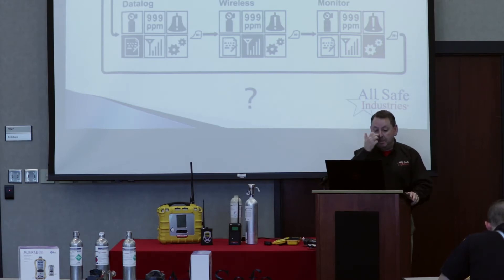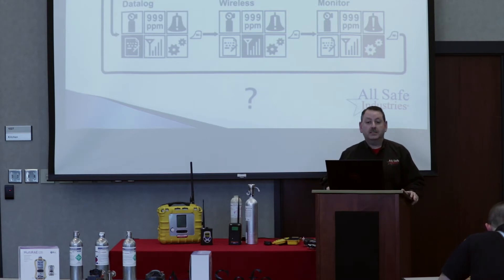Hit the back button to jump out to the next main menu. The next main menu is your measurement menu, but I'm going to skip it and come back to it last because that's where I'll teach you correction factors. Go ahead and advance over to the alarms menu and hit select. You'll see sub-menus where you can change your low alarm, high alarm, your STELs, your time-weighted. Right now it's set to OSHA standard, so I would leave that as is unless your standard operating procedure says to change those alarm limits.